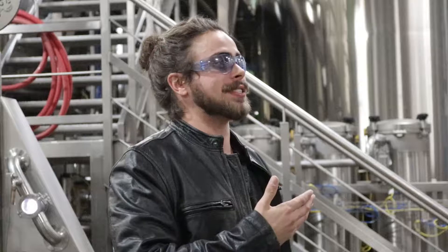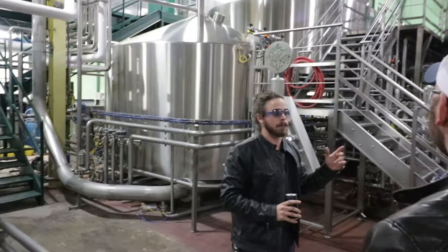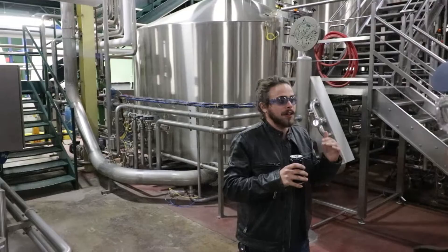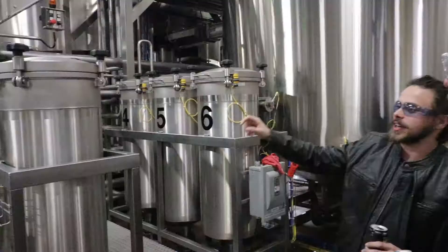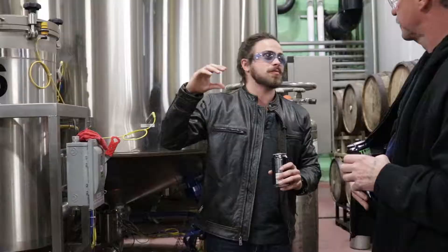It's pretty hard to time out exactly how much malt or hops you dump into a big vat like this. So those computers are going to streamline that whole process and make sure that the malt and hops we're using get added to the brew at very specific times, making sure it's consistent. We don't want two different tasting Hopsecutioners out there on the market. If our hops are added just a little bit too early or a little bit too late, that can mess up the bitterness and aromatic profile of the beer. That recipe plugged into the computer up top is going to open and close the valves on the back automatically and let wort flow through the hops at a specified time — really important for us consistency-wise.